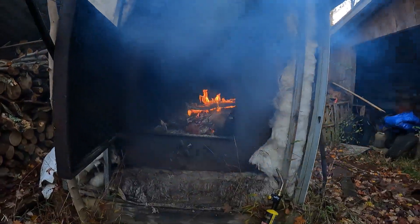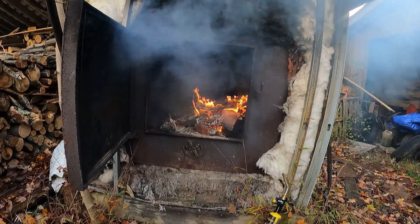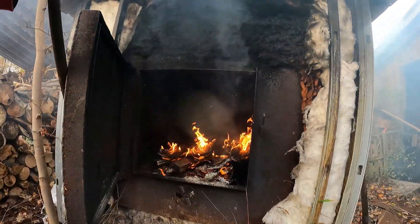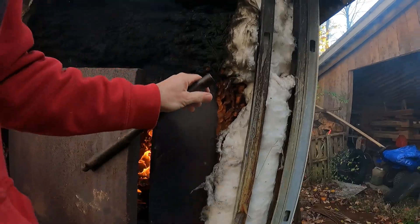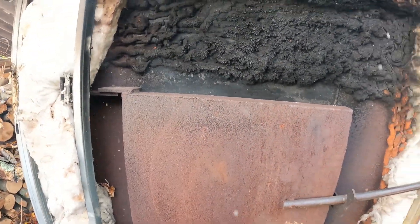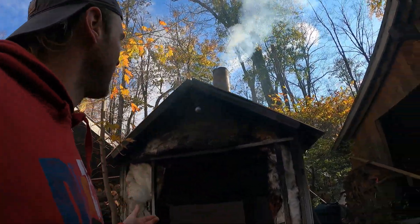Got her burning. I haven't done anything to this in about half an hour - it's just sitting here. Wood is all lit, paper's all gone. Good to go and she's nice and warm. Now we've built a little bit of heat in here, we're going to flick on our circulator pumps, get this running, circulate the water through the house, heat up our floor. We have radiant floor heating. I'll put up a link so you can check out how that system works.